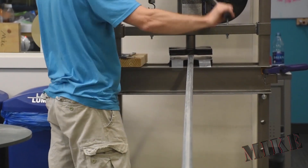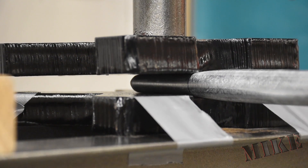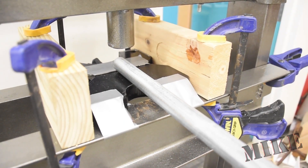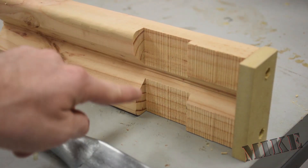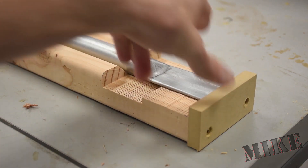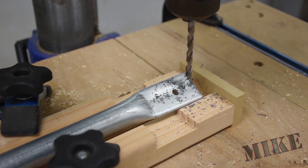About 24 pumps and it gets flat. I tried to do more of these at a time and mark where I was going to bend them with this little piece I cut off as a marking jig. Still not quite idiot-proof. I ended up using a saw blade as a conduit stop and then some two-by-fours and clamps as positioning jigs for the top plate, and it worked really well. Then here's my drilling jig — I cut a v-notch down the middle. This deeper dado here supports the transition area and this little shelf at the end supports the flat portion up against the end stop. I got it one inch from the stop in the drill press and that allows me to drill consistent holes one inch from the end.